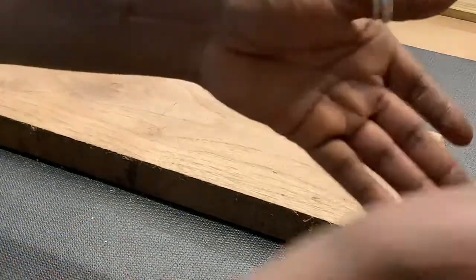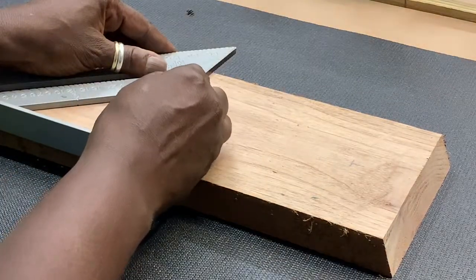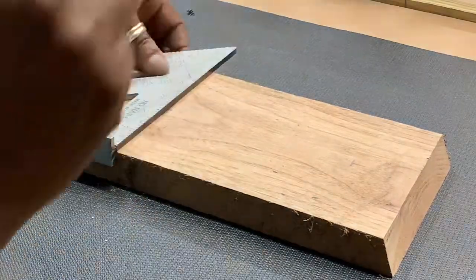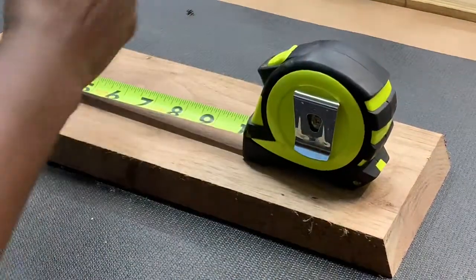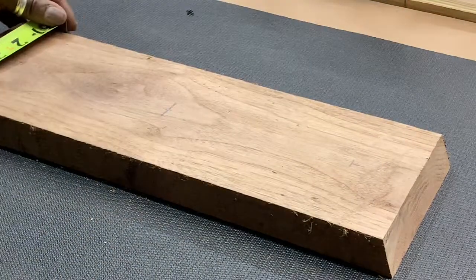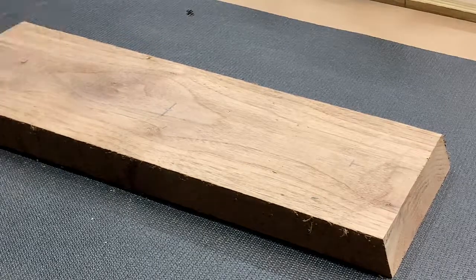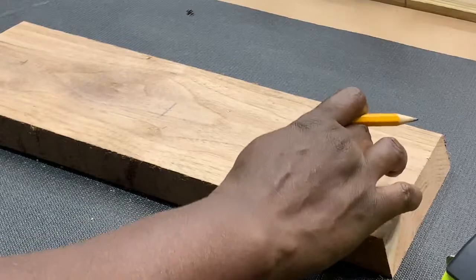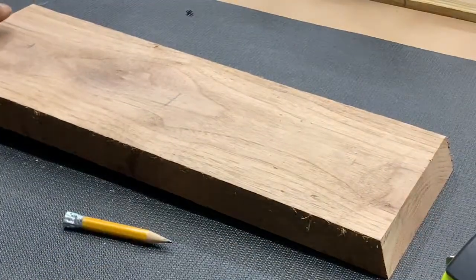And then I just took my speed square and made a line right there, and I did the same here. I came in 2 inches from the side, made a mark, 2 3/4, made a mark, and that is how I got that hole and this one for our next project. All right, so can you guess now where we're going? Yay, to the drill press. So follow me over.